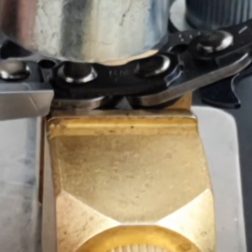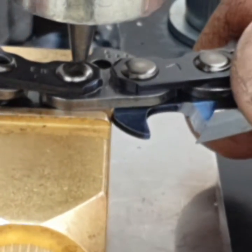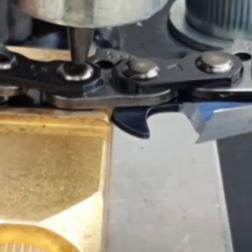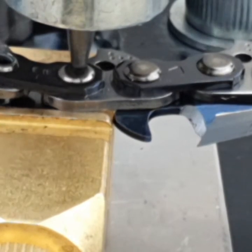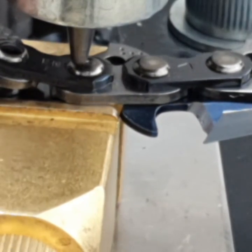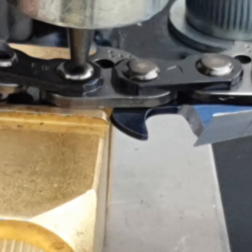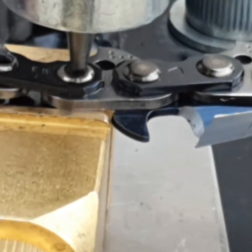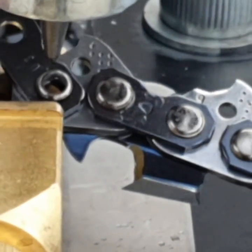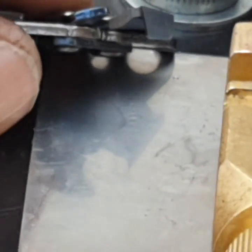Push down — that's the first one. Move it across to the second one and make sure you line it up in the middle of the rivet as best as possible. This is the most critical part because if you get it wrong you'll damage the punch. Now that's just broken — that's what's supposed to happen.